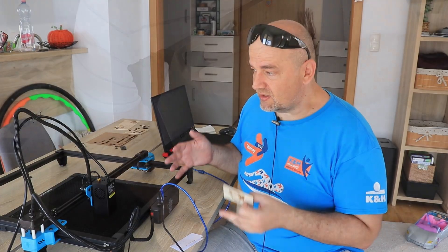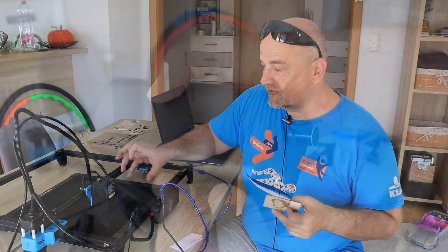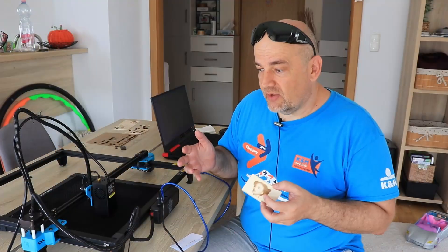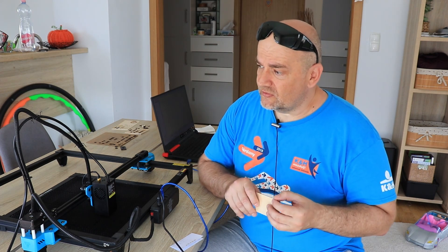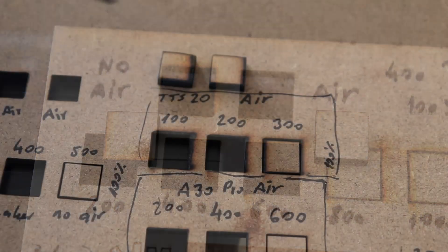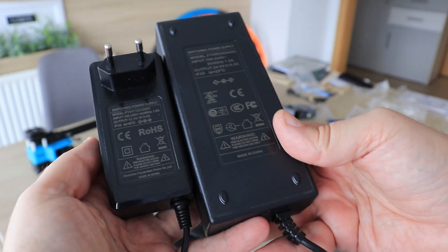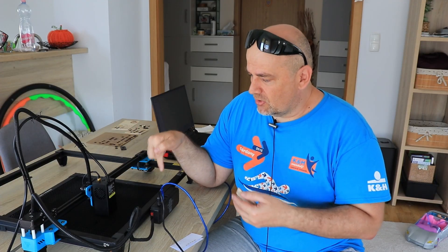Some conclusions. It's very nice that it arrives fully equipped with the honeycomb grid, steel plate, and air assist pump. I was amazed by the small size of this 20W diode laser module. It is not as strong for cutting as 30W diode lasers, but for engraving I feel it is even better — much nicer, sharper, thinner engraved lines. The air assist pump could be a little stronger; with plywood I got nice sharp edges but with MDF I could still see burned edges. With two separate power supply units for the pump and the engraver, we lose the advantage in LightBurn of combining different operations, since for engraving you don't want to use the air assist — only for cutting. A relay controlled by the mainboard could be a solution.